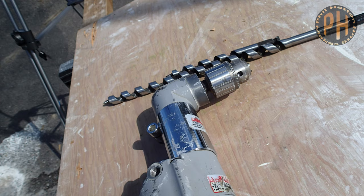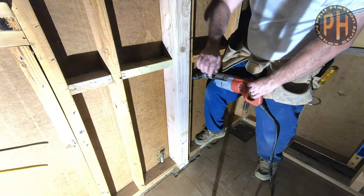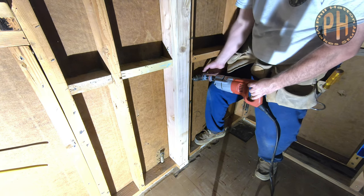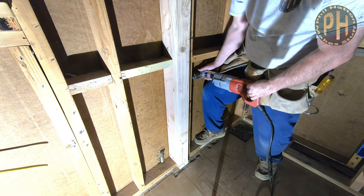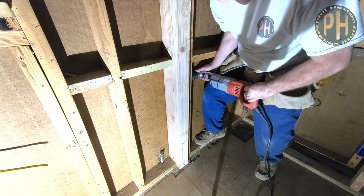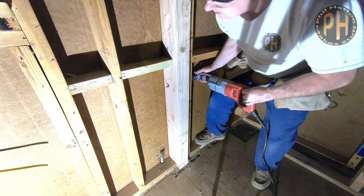If you are drilling holes for electrical wiring, you'll be using an auger bit, and at some point it will bind up. If you have a big right angle drill, and if you're using a bit with a quarter inch shank, it will snap off, leaving you with an unfinished hole with an auger bit permanently embedded.